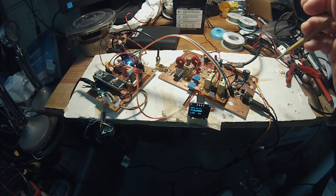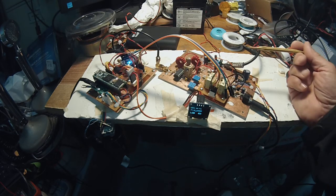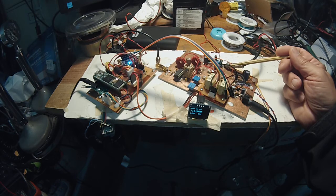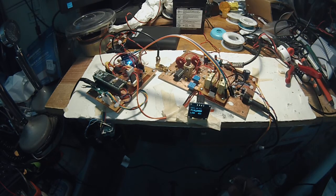From there, we just introduced yesterday the two 600-ohm to 600-ohm isolation transformers. And by the way, I know this thing really works well on upper sideband. I had these connections reversed. And so when I first turned it on yesterday after installing these two transformers, it was terrible. It was all upper sideband. So I know this is working really well in terms of discriminating between sidebands. I didn't copy any lower sideband at all. I mean, I was not copying the opposite sideband. So the Teensy is really working well there.